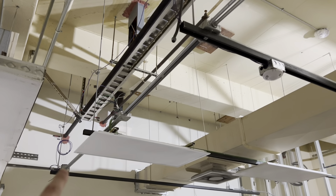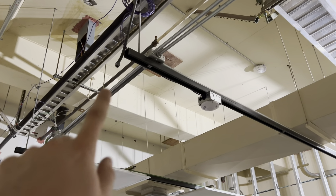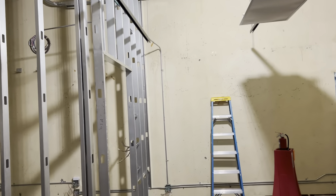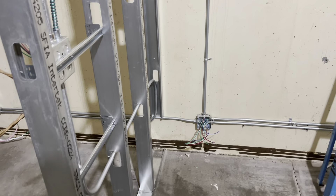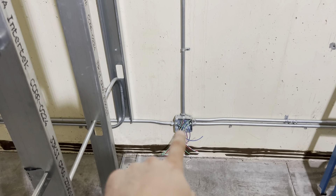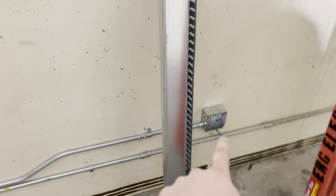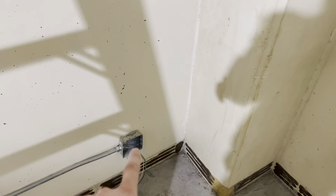From there, pulled in the red and the blue from this first box through the second box to the third box, all the way down over to here. So we pulled this in, took off these older receptacles of 28, pulled in a new circuit for 28, which is red. And then the blue for 36, because this is going to turn into 36. This one is turning into 36. The new one is 36, the old one is 28. So pulled the new wire down to there.